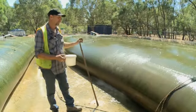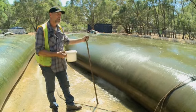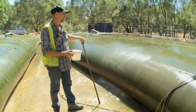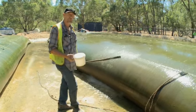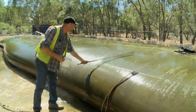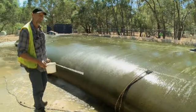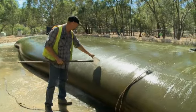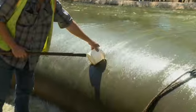These are our dewatering tubes — this is where the sediment gets pumped into after being dosed. The bags are basically a permeable filtering bag. You get a small build-up of fines on the inside of the bag as a second layer of filtering, and periodically you need to give it a small tap just to release some of the extra pieces — it just helps drain the sediment. You can see that what went in at the dredge, the black, has stayed inside, and that's our filtrate coming out clear.